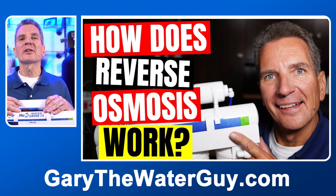If you're on well water you may have iron or sulfur in your water. Sulfur is that rotten egg smell often associated with cottages or well water. To get rid of those, you oxidize them — you oxidize the iron out of the water so you can trap it in the tank, then backwash the media inside the tank every three days to keep cleaning it out.